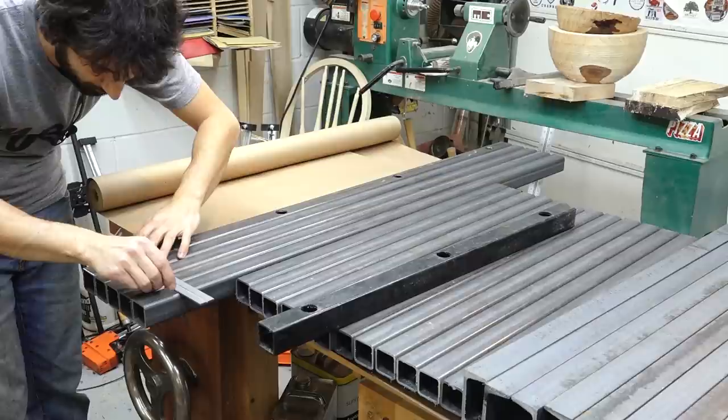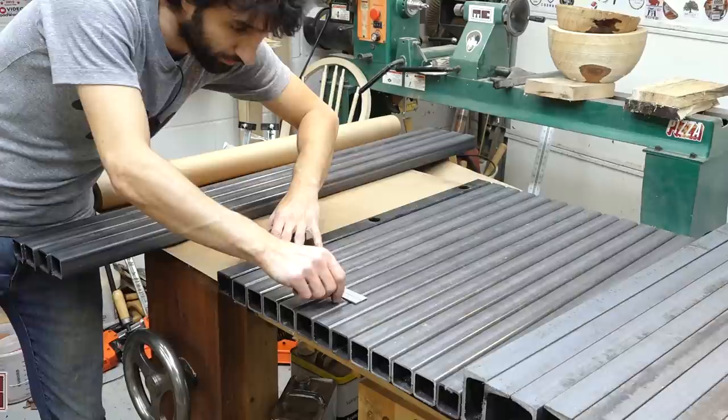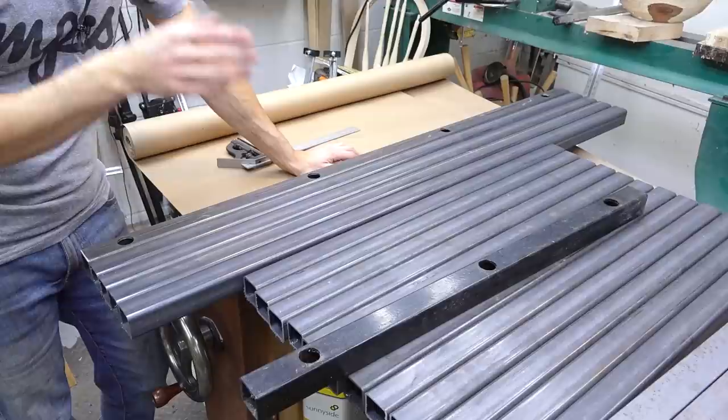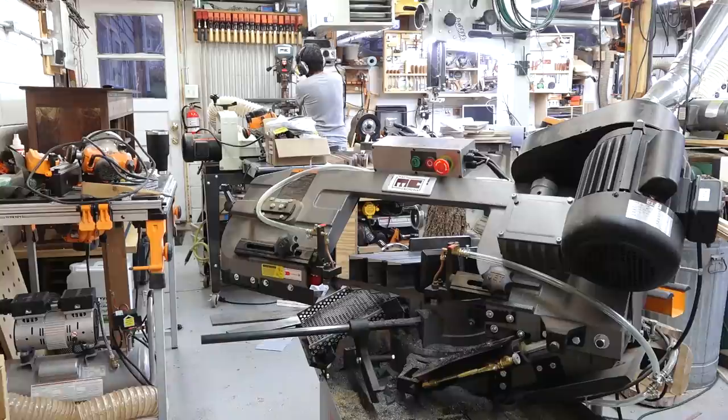I'm using these pieces as a story stick to set the hole locations. It's going to be really easy on my unpainted four-foot one because I still have the scribe lines on there. The scribe line on the 30-inch one is covered with paint, so it's going to be a little more eyeballing to get the center of that hole. But these don't need to be super precise anyway — there's about 3/16ths of an inch of tolerance between the hole and the stud. The stud is 3/4 inch and the hole is 15/16ths.